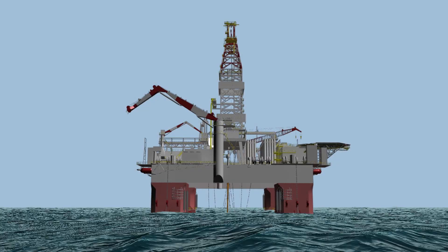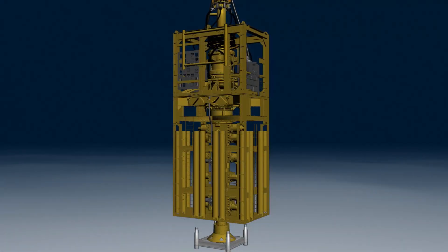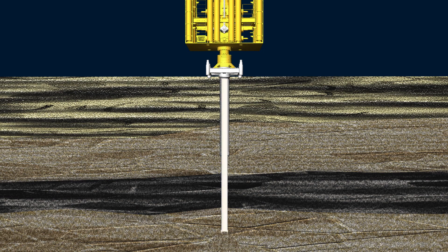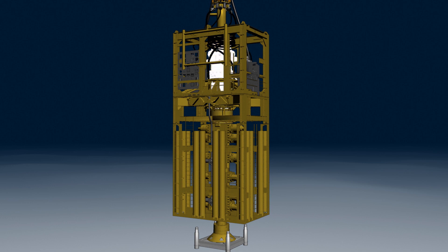In summary, the GE oil and gas drilling products are designed to help our customers drill wells safely in deep water applications. The casing, conductor pipe, guide base, and wellhead provide the foundation for the blowout prevention stack. The lower stack contains a series of ram blowout preventers. The LMRP connector holds the two sections of the stack together, and the LMRP is equipped with annular blowout preventers and control pods.